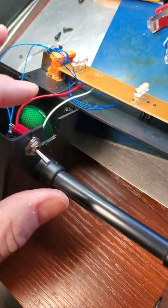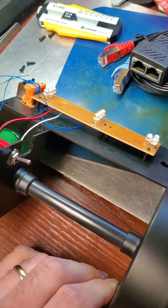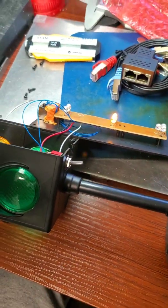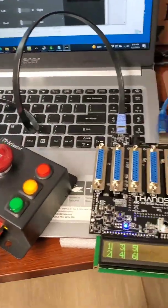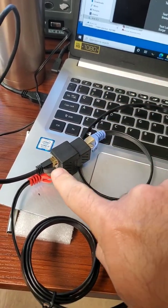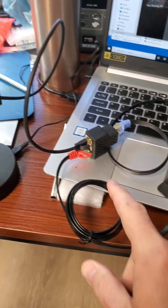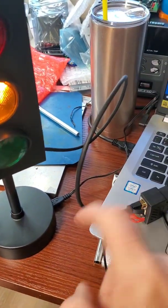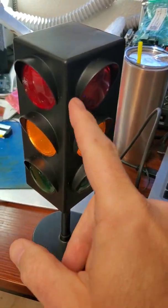All is wired, and I also included a little switch to enable the normal function when I don't have E-stop lights connected. So I have the normal cable — RJ45 going to RJ45 — which in turn copies the signal to two wires, so I can have my E-stop, normal E-stop, connected. The other side goes to the little traffic light we have here. It gets power from the little power supply that comes with it from USB, so no power comes from the MC — only the signals — and it activates the LEDs on its own.